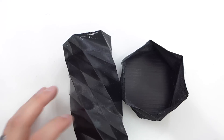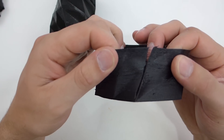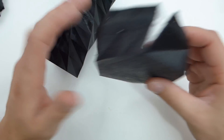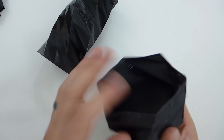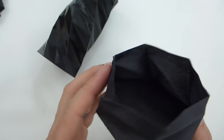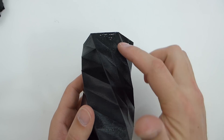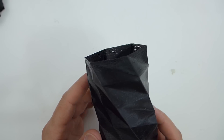Some vases: the big one was printed on the ForgeTech FT5 and this was looking okay from the front, but when I got around to it, I saw what looked almost like retractions happening, but it wasn't — I double checked my G-code, retractions were off and it was printed in vase mode. I don't know why it did that. The jerk settings may not be proper on that machine for this. So I printed it smaller on the 2023, and it was going fantastic until we got up to the top. I think this flexible filament is just a little too flexy in the way it works — I did have some under-extrusion there. I did dry the filament several times between a few of these prints and it just kept giving me issues.